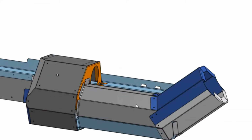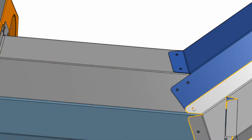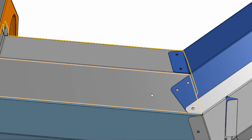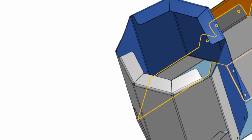So one thing that I forgot to do, I can see in the model now, is this. There's an underlying flange here, then an overlapping one from those two pieces. Normally I would have 3 screw holes along here to latch those tightly together. Now there's a screw back here that ties them together, maybe even 2, and then they're both screwed to the side face of the turbine cover. But it still wouldn't hurt to shoot a screw or 2 through this wall. I'll probably change that in the design for future runs of this kit, but if you've got one already, you may want to punch a hole, or once this is on, you can shoot screws through it because they're self-drilling and tapping screws. Similarly, on the back side, you can see where this flange overlaps, and I would put a screw or 2 in here if possible, just to make it a rigid, tight enclosure.